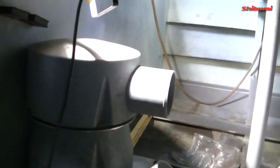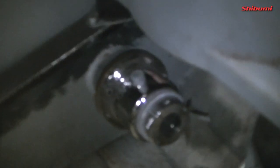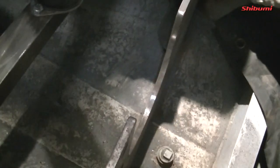That top part has to be turned obviously towards the side. That's just an adjustment. And I have full clearance on the top of the stern gland. So I have total space there. We'll put something else in this area here when I need to. And the centre bearing has tons of room around it. The flexible coupling. So the shaft will come up there. It doesn't meet that angle iron. It's well above it. So happy with that.